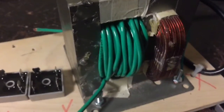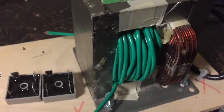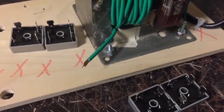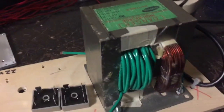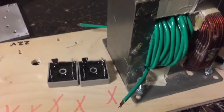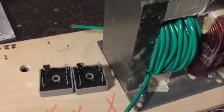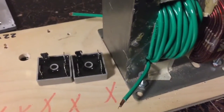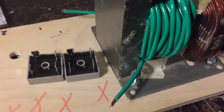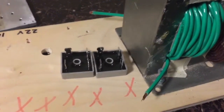That was really hard to wind, so I rewound it with more turns of green 12 gauge wire than I had before. I'm going to connect in a total of four rectifiers and then connect those to heat sinks, so I should be able to get some good output. I measured the voltage across the green wires with it plugged in and it comes to about 22 volts, so that should give me at least 30 volts DC once it's rectified.